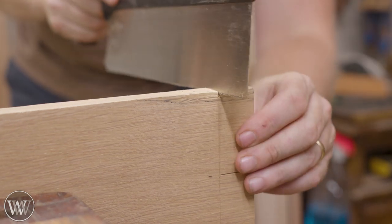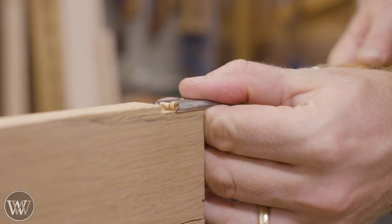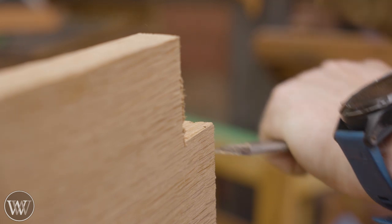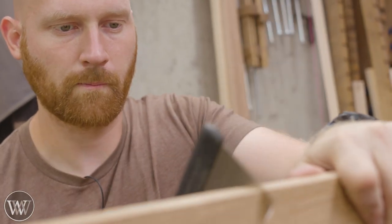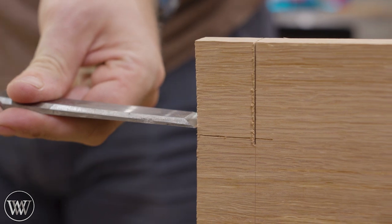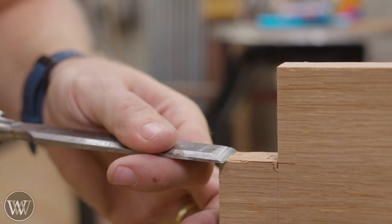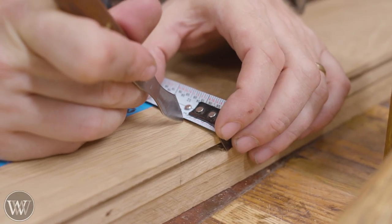On one end of the tenon we cut down about a quarter inch, and on the other end we cut down about three-quarter inch. Get it close to the line, then come back and peel it right down to the line to get a nice shape on the tenon. On the other end we take off a large chunk, which is always fun — taking off large chunks with chisels is always enjoyable. Now we have one end cut with the joinery; we can then cut the board to length. Again, don't cut to length until you have the joinery on one end — it will save you lots of trouble. I don't know why someone would want to do this with a power tool when you have a chisel in hand, but to each their own.